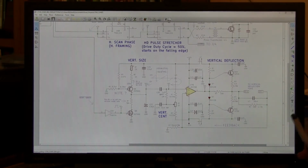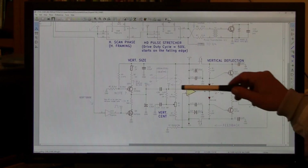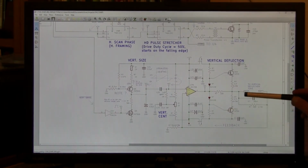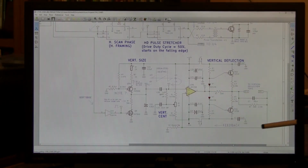And in the end, we get a beautiful low-going minus 12 volt flyback pulse when the ramp falls, and then it jumps back up and then scans between minus 100 milliamps and plus 100 milliamps or so on the Cyclops monitor, which is what I use to visualize scanning. And that is, in essence, the arrangement of this vertical deflection system. It contains a total of 4 transistors and 1 op amp. It has taken quite a bit of labor to get here because of the aforementioned mistake.